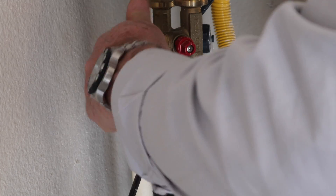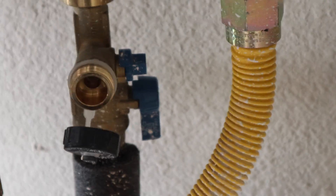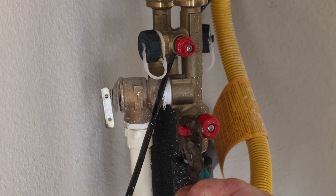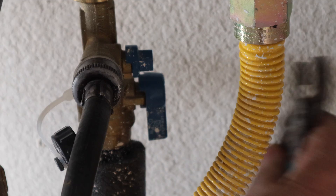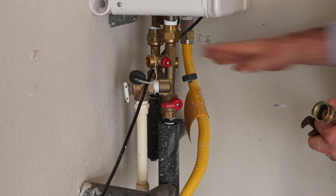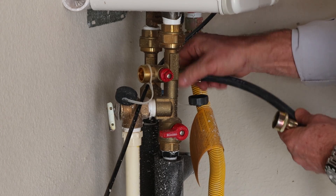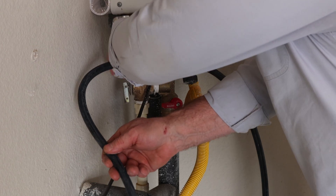The first thing you're going to do is make sure that there are valves for flushing. You've got an inlet and an outlet because you want to go the same direction as the water. What we're going to do is turn off the isolation valves — turn the valve across, that puts a stop in it. Now we've completely isolated the tankless water heater from the house. We're going to make sure our washers are in there, hook our hose connections up. These are literally washing machine hoses, and they work great.